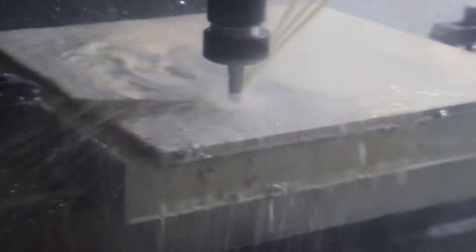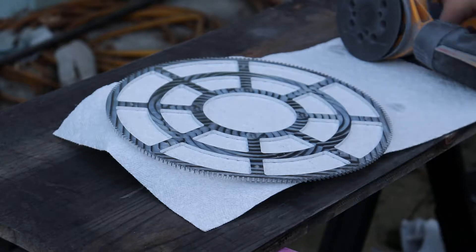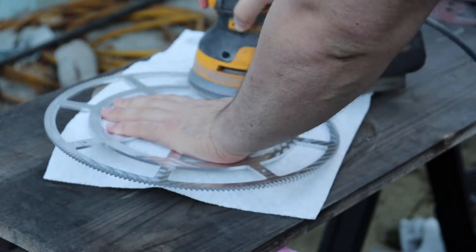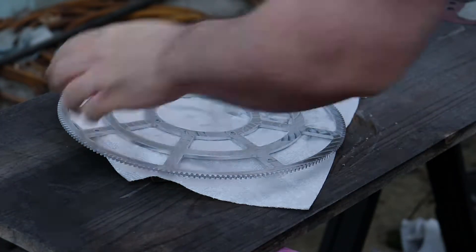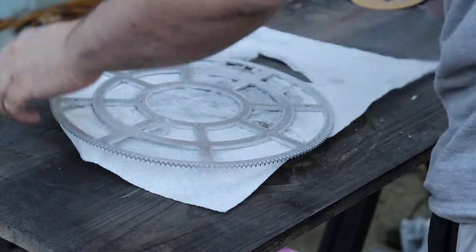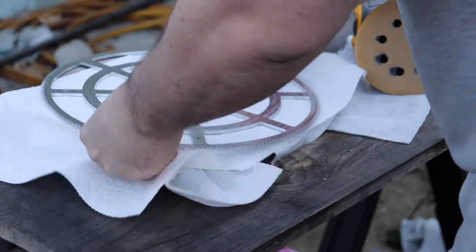Here's some footage of making the top plate, which is the most visible part of the orrery. Each planet in the display stack is driven by a large gear. The toolpaths are highly visible on these gears, which is not the effect I want. I have 9 of these gears and they are huge, so instead I use a random orbit sander with a 5 inch disc. These discs, which I suspect are primarily for woodworking, wear out very quickly — I found myself using 4 sanding discs per gear. This video is obviously sped up; it takes around 30 minutes per gear to get a really nice finish.